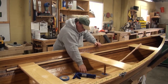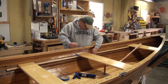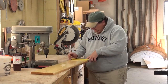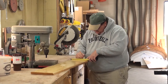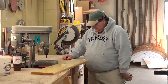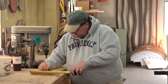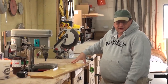I'm going to finish putting my lines on this, then countersink and drill down so we can get ready to put our screws in. For deciding where the screws go: I've got eight inches here for my seat, so I come in two inches, then four, then six — basically a four-inch interval between screws and two inches on either side. I'll do the same on the other side for a nice even look: two, four, and six. Then it's just a matter of drilling down and countersinking, and then we're ready to start caulking.